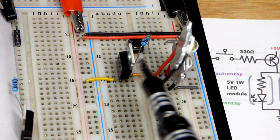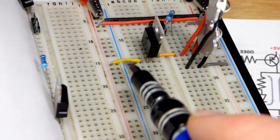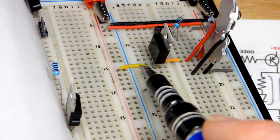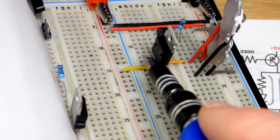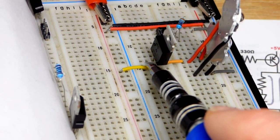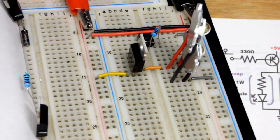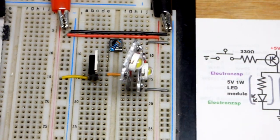The pin layout: the left pin is base, the middle pin is collector, and the right pin is emitter. The metal tab in the middle is actually electrically connected to the collector — it's essentially a single piece of metal. So whatever you connect to that tab, you're also connecting to the collector pin. Something to be aware of.